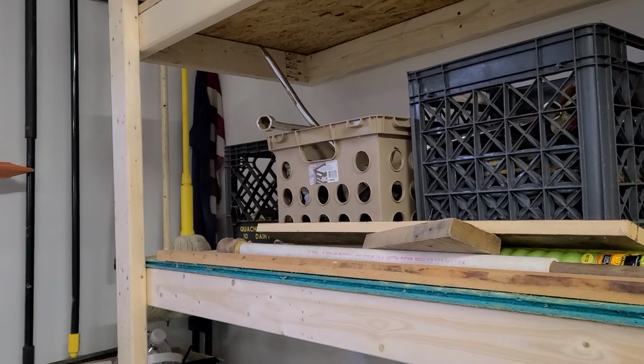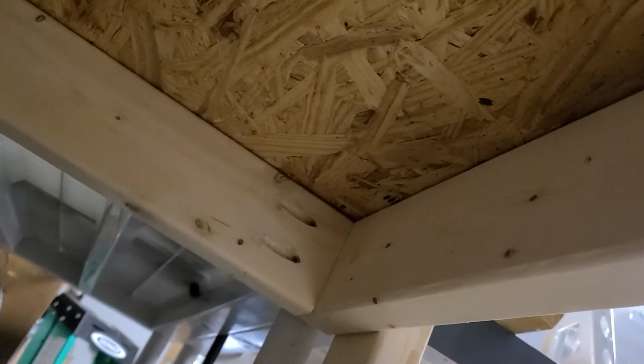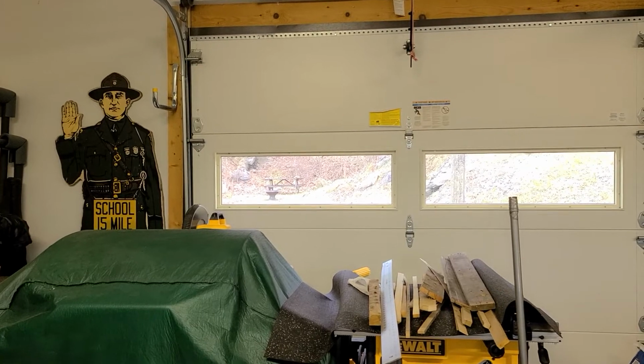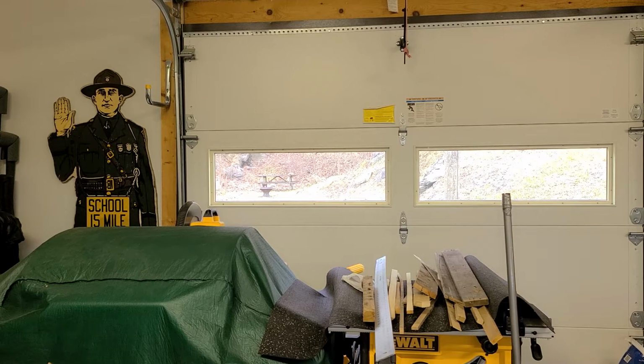But anyway, so yeah, I'm going to put these supports there. I'm going to use the pocket holes just like I did everywhere else. You can see in there, there's pocket holes and there's pocket holes, and I'm just going to do the same thing. It's just going to make it clean. And also it won't show the screws on the front, especially since I'm going to be putting 2 more up top and 3 across the bottom. It's not going to show those 6 screws across the bottom right on the front plate there. The ones on the side are showing, but like I said, in hindsight, I should have done it from behind. It'd have been cooler, I think, but it doesn't really matter.